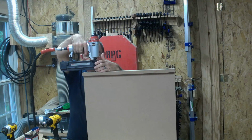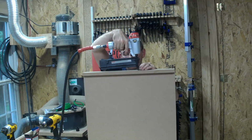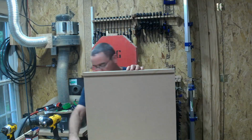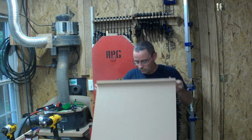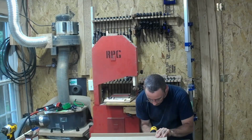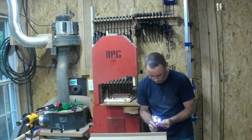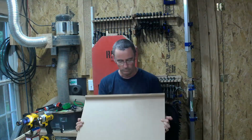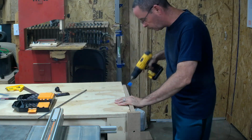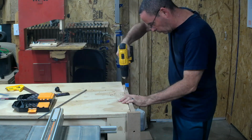The pivot board gets the mounting board also attached with brad nails and screws. This needs to be flush on both ends and centered on the pivot board. Then the pivot board can be placed on its side and the pivot holes drilled according to the plans, or whatever radii you want for your fretboards.